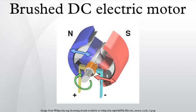For overloaded conditions, motors are protected with thermal overload relays. Bi-metal thermal overload protectors are embedded in the motor's windings and made from two dissimilar metals. They are designed such that the bimetallic strips will bend in opposite directions when a temperature set point is reached to open the control circuit and de-energize the motor.